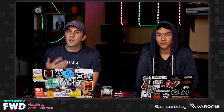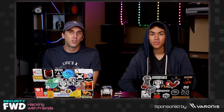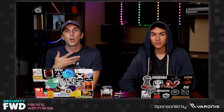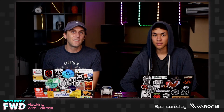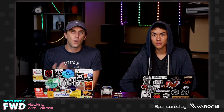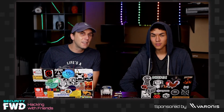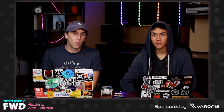Now again, we were looking for an access point today, but this process could be changed to use Bluetooth, or it could be changed to look for any type of wireless device, including smartphones and other things that are just broadcasting, looking around for wireless networks and aren't broadcasting their own access point. So while we were making this very clear and easy fox hunting example today, going after an access point, this could easily be modified to go after, say, a pair of headphones with a Bluetooth interface if we changed this over to an ESP32 based design, or just a smartphone that's probing around for nearby Wi-Fi networks.